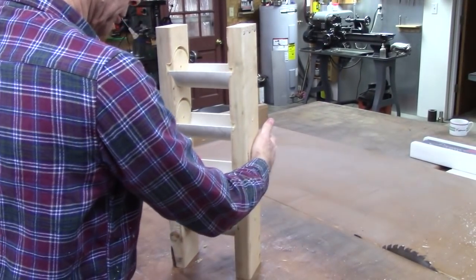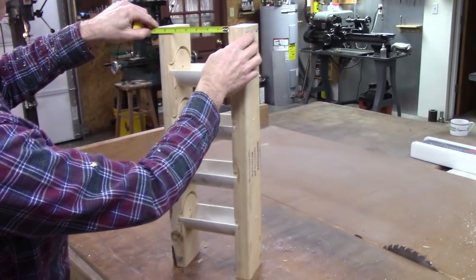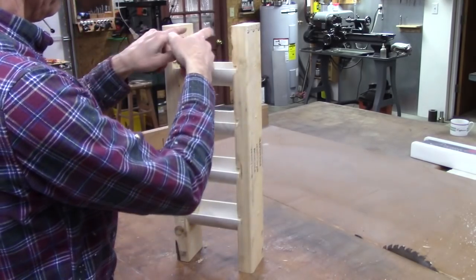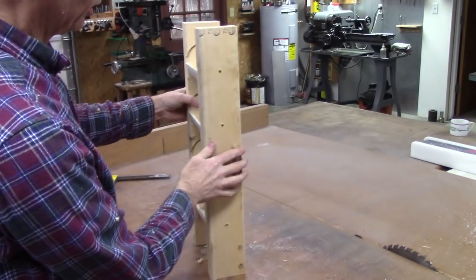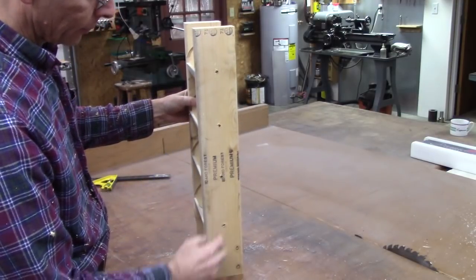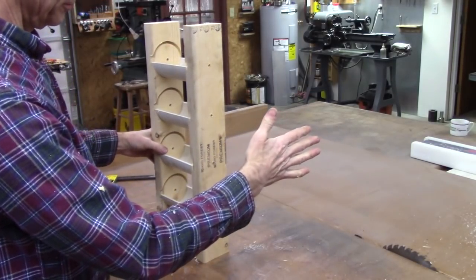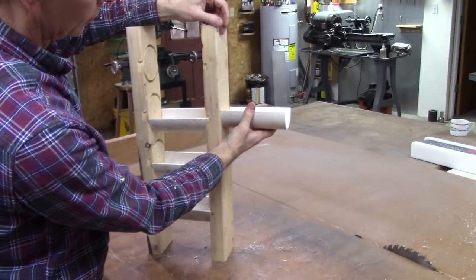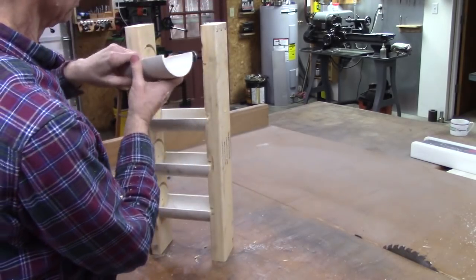And there it is. Cut a 2x4 — that's 5 and a quarter inches. Put the 2x4 in there, nail it, screw it together, whatever you want. The neat thing about this way of doing it too is there's a pilot hole here. If I want to put a hole saw cut in there, or a circle cutter groove or whatever, I can make two systems — in other words, have one of these into the 2x4 like that, so you have three uprights and two sets of trays.